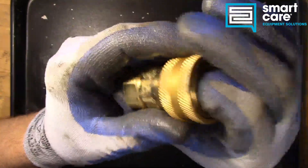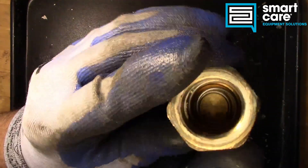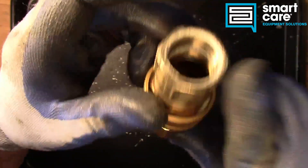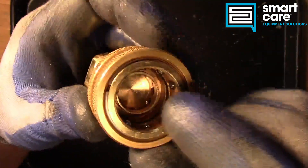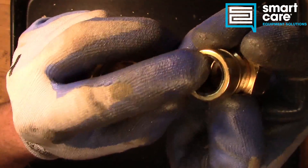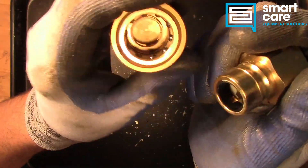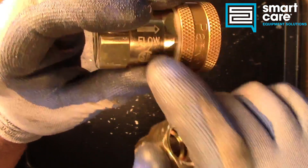And that is a check plunger. So that plunger has a spring behind it. You can see if I push it in, it moves — does not move very far. If we put the nipple side back in, you can see it kind of lift up as that seats in. The holes drilled around it here allow the gas to flow through it. That lip that's sticking up pushes directly onto this plastic ring — this bushing. And this is the fire protection device I mentioned earlier. So if it gets too hot, it starts to lose its shape, lose its form, and that spring pressure on the plunger will push it into that nipple and close that safety plunger.